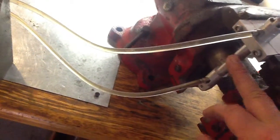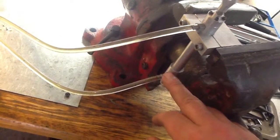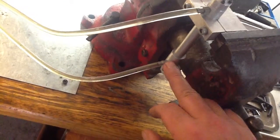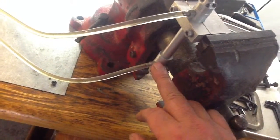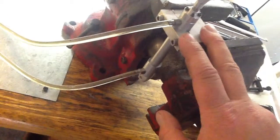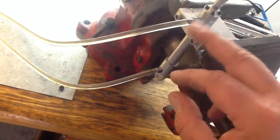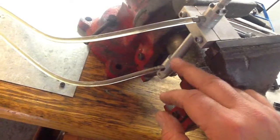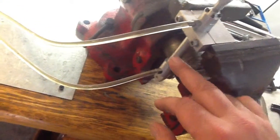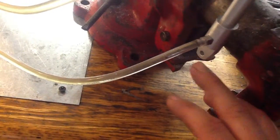So there are three pieces that were made. First there was the piece of hollow stock, the pipe. And then the sealed end was made from one piece of that aluminum bar stock — solid stock. And then the other end was made up there. These parts were all machined up on the lathe and I just simply glued them together with two-part epoxy. It worked great. I also want to point out this flange that's on the end here — I machined this on the lathe and got a nice radius milled on it, got some angles and notches so that it can be connected to something.